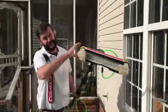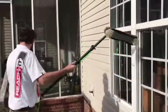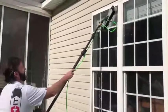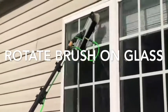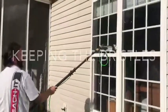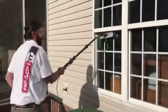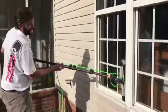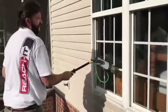These windows don't have an inset frame so we don't have to worry about the frame as much. Using deionized water, the secret is to come in at 45 degrees and not wet that top frame. I'm turning the brush down low rather than up high. You can see that window is cascading, so it's hydrophilic. This window is actually hydrophobic, so it's easier to rinse with a straight pull.